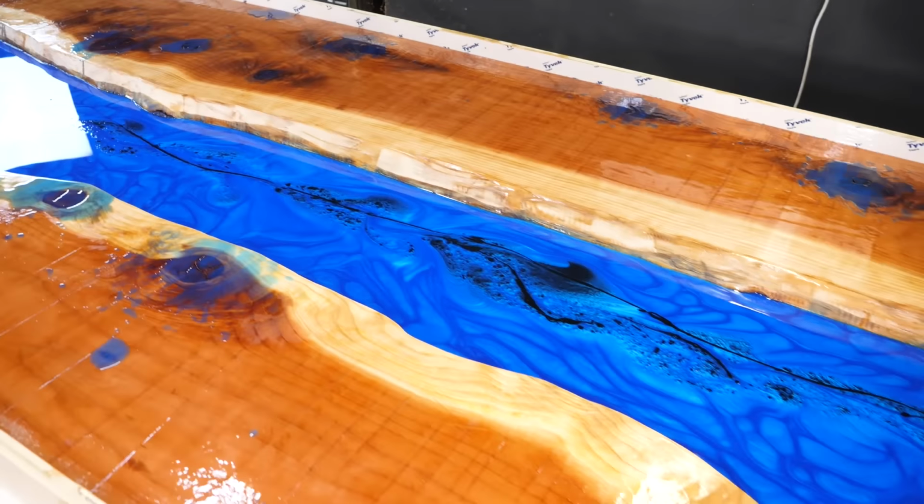The steps are pretty simple, but require a little bit of practice before going over your customer's kitchen or giant woodworking project. You're going to want to sand the surface with 220 grit if you're going with matte, or up to 320 grit if going with glossy. Remove any dust using 91% isopropyl and a microfiber rag, and then we're going to remove the lint from the rollers using some masking tape.